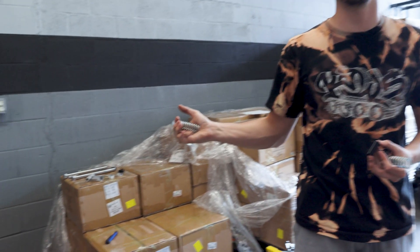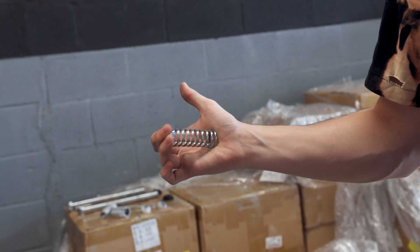I'm about to throw in these two springs, which is going to double the spring rate or add another spring rate to it. Then I'm going to put these rubber dampers in the middle. I went with a stiffer spring rate — this is going to compress a lot less easily, giving us more rigidity and a better overall off-road feel. I thought it was a little bit soft to begin with. I asked that I could build this bike so that anybody up to about 220 pounds can ride it comfortably. I figured with all the rough riding I'm going to be doing, build it for a heavier rider and just beat it.